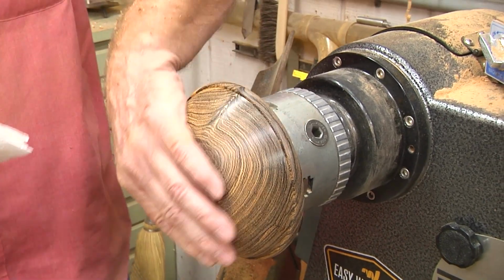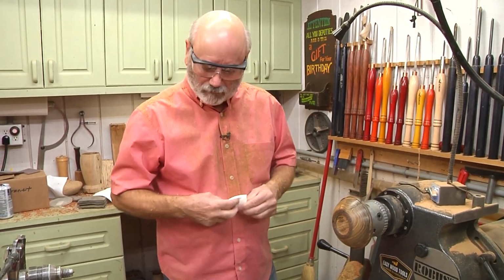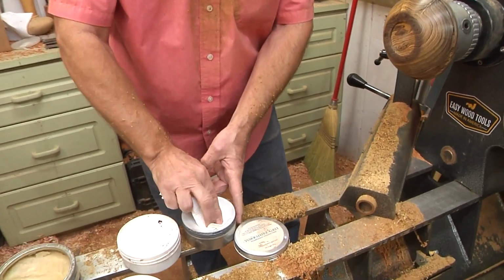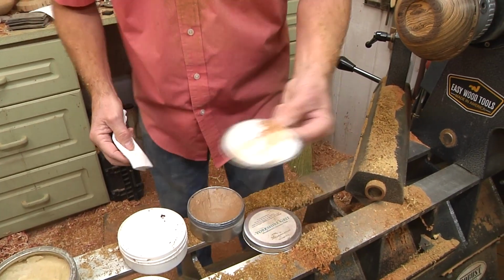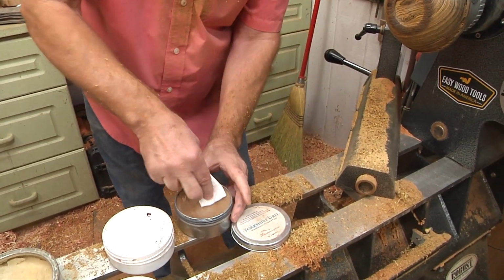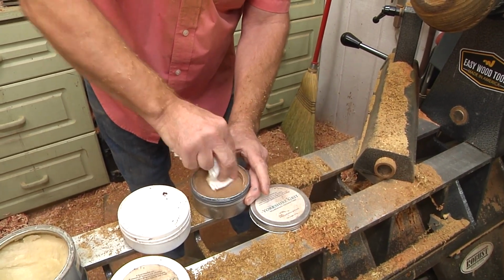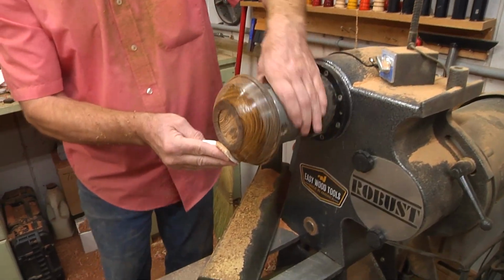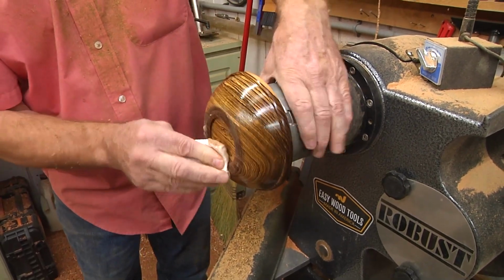I've sanded now to 325, 400 something grit, 400 grit. We're not done. So I'm going to use Yorkshire grit, and it's a two-piece application. This is the grit. Oh, yeah, that didn't... Okay, yeah, I thought the color was weird. So anyway, it's a paste, but it's got microfine grit in there, like it says. So we're going to just kind of put this on here before I spin this up and get splattered. Put it in here. There, where we're going to go.